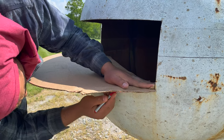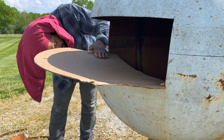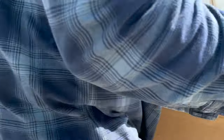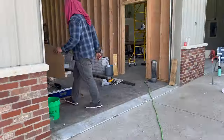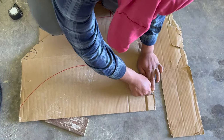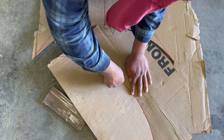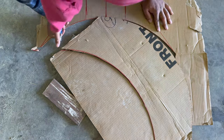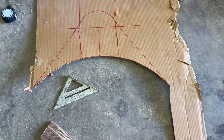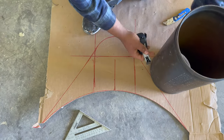So here's what you're looking at. I got a piece of cardboard, and what I did is I just traced a bottom arch which will be the bottom of my collector, because we need the curvature of the tank to cut out. I just shoved cardboard in there, took a marker, drew the curvature, and then I'm about to cut it out. When I move this cardboard away, you'll see the actual piece I'm working off of. Make sure you do it on a pretty big piece of cardboard — the one I just cut is an example, this is the real deal.